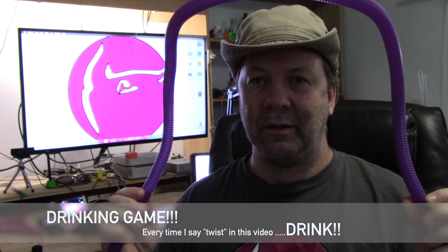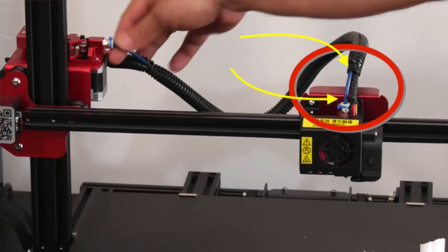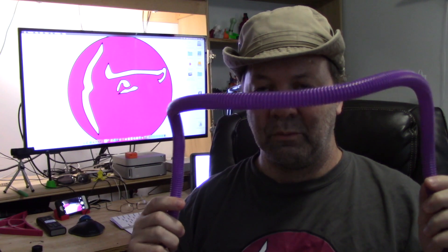Here's the issue and here's an easy fix. All you have to do is simply twist it and it will lift. The other thing you have to do — and I'll show you a picture — is support both ends. You can't let one side droop; it won't stay twisted. You can't just attach it to the wiring. In his case it's stock, he's not doing anything wrong, it's pre-built. But if he takes a zip tie to the carriage, just before attaching it, take it and twist it.